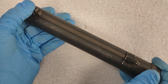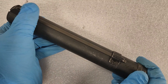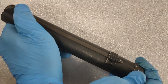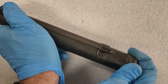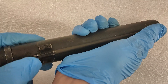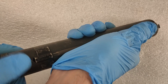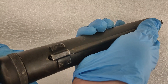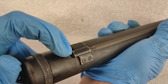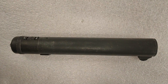There's your safety from before - you pull back on this and then forward on the rod. Very awkward to do at this angle, but it's not impossible. So eyes on the end of the rod there, pushing forward with the mechanism, and there goes the striker flying forward, because that pin has been allowed to pop up out of the way of the striker. And pop goes the sleeve gun.